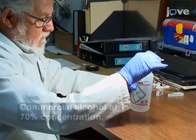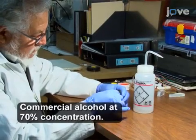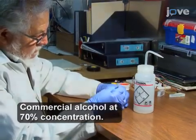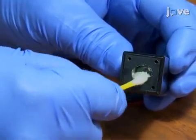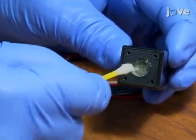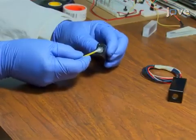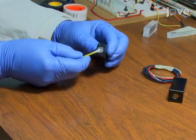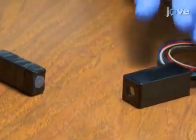Use alcohol and a clean cloth to clean the photomultiplier tube light entrance. When this is done, get optical grease and apply it to the light entrance until it is covered completely. Return to work with the scintillator and apply optical grease to its uncovered surface. After the optical grease has been applied, align the photomultiplier light entrance.